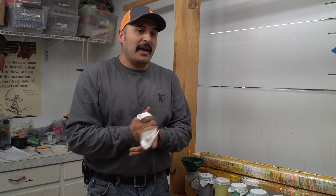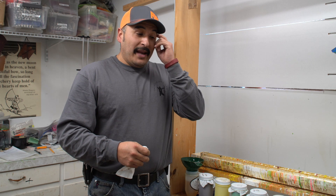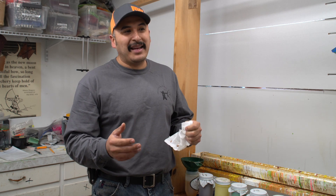Daly's does have a shelf life. Once I open the can and start using it, it will last me about six weeks before it starts to go bad — that's during the winter. During the summer, depending on the humidity and temperature in the room, that time will shorten. Last year in August I got about three weeks to a month out of a can before it starts to get cloudy. You'll notice when you start to dip it gets thick, and then it's time to change it out.